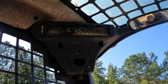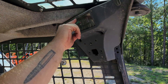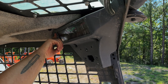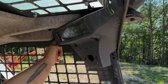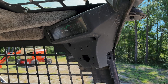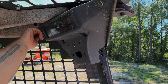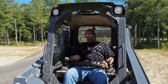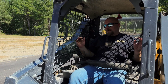You also have your dash cluster to show any codes or faults you may have, and your hour meter screen. If a code pops up, go into the menu, scroll down to where it says codes, and hit select. You'll be able to see what the code is to include in your service call and give the technician more information on what's going on with the machine. Note that some skid steers have controls in different spots, but they all function the same way.